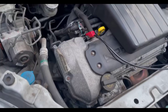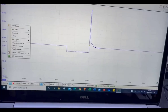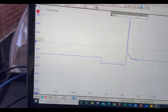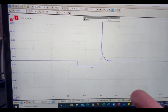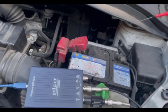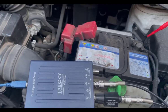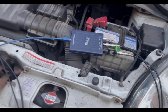Let's swap those leads over and see what happens. So I've just swapped the leads around — red is to black and black is to red. The waveform is now showing something we're more comfortable looking at, but the voltages are exactly as I described: zero and then it drops down because it's the other way around. Now I've got the ground lead off channel B and I've put a fuse on it because I have a feeling I know what's going to happen. Oh — straight away, popped it straight away. This is something you've got to be very, very careful of, especially when taking measurements with the 2204A, as much as I love it. Well, there goes my warranty on the 2204A — I hope you all thought it was worth it.